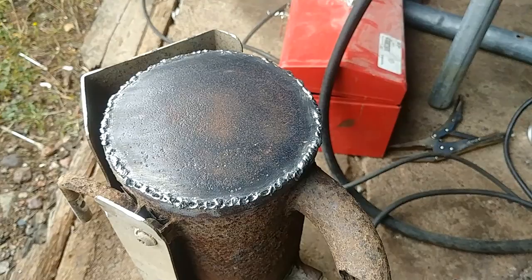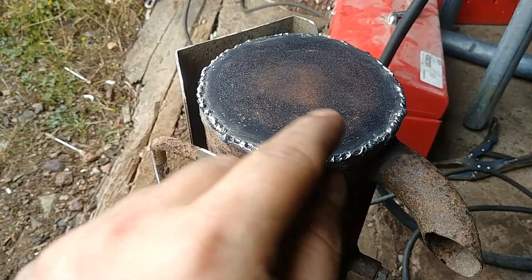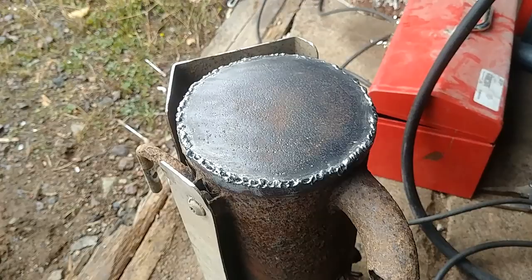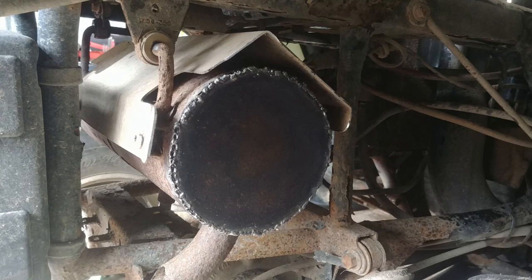Obviously a really poor job, but again, with what I was welding onto — not much. It held — just a series of tacks. You can't run any type of a bead; a tack is all you can form because this is just so crumbly and dirty, just spattering and flicking and popping — just a mess. But hopefully that'll quiet it down. I'd suggest looking for a pipe somewhere at a scrap shop or something. It is much quieter now though.